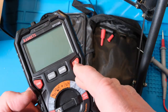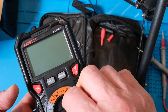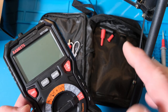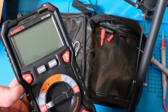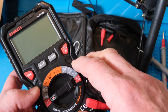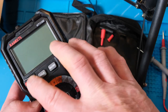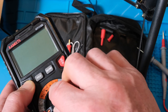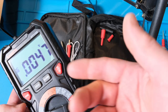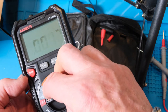This thing turns off after 15 minutes to save its battery. But if you don't want it to do that - a lot of times when I'm at the bench I'm working and I don't want my meters turning off automatically anymore. So I just want to turn them on and leave them on. The backlight stays on, which is great. The other thing is, hold the function button down when you turn it on - it gives you kind of a beep but then turns off the automatic sleep mode.